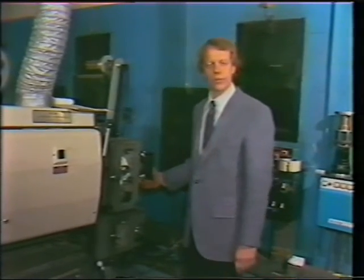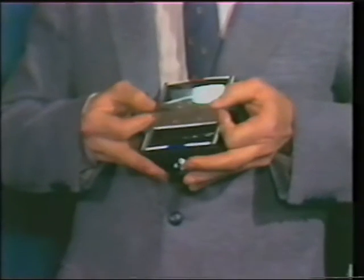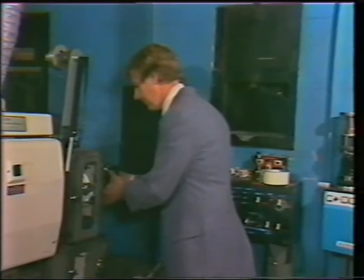So now we're ready to see the show, right? Wrong. There are a few more things necessary to make a really excellent 3D presentation. Because of the way the mirror box works, there will be spurious images generated on the screen. To eliminate these, it will be necessary to mask the mirror box. Masking should be done in the center area only — bring the masking down only as far as necessary to darken the spurious images. The projection port provides a second area for masking. You will probably be able to see the double image created by the 3D lens on the projection port — again, the center area should be masked. If you are operating without an aperture plate, this is an ideal place to mask off the soundtrack. Be careful not to get carried away and darken the main image — only enough to darken the spurious images.